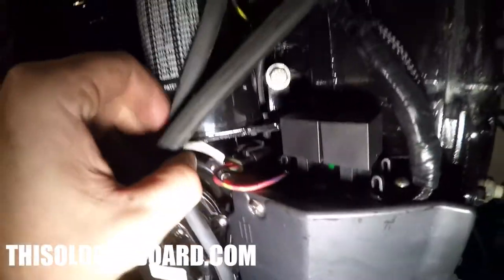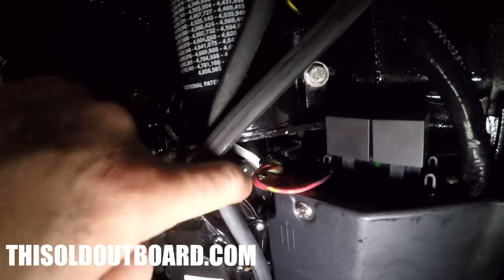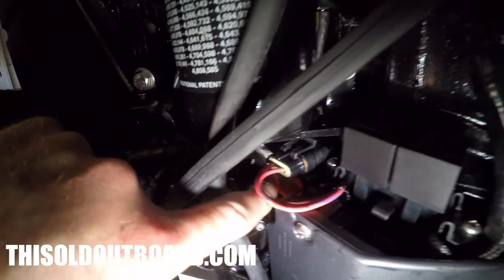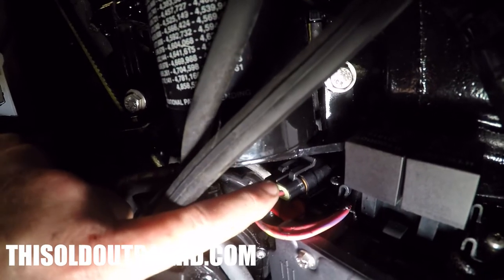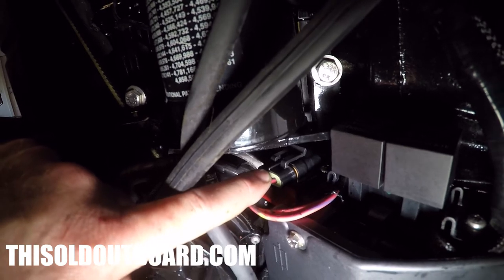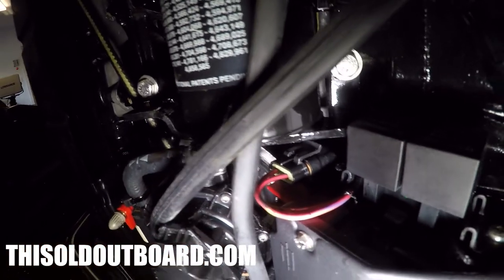If it won't go up or down, there's a fuse holder here. There's a spare fuse — you can see that red T-handle where my finger is. You'll need to check this and make sure you haven't blown a fuse. If you blew this fuse, it wouldn't go up or down. There should be a spare fuse underneath it — that may be your issue.